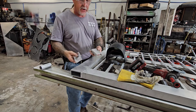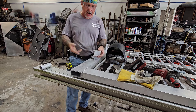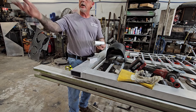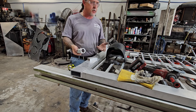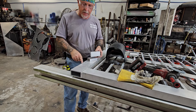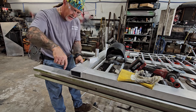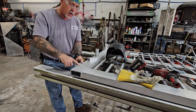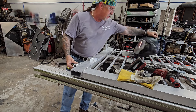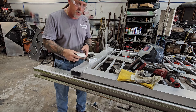This is channel for gates — I have scrap of this laying around all the time. A piece of scrap handrail pipe — I probably got 15-20 sticks of this, so drops are common. They go together like this, simple as this. Bevel the edge, bevel the edge. I come up four inches and you can see it's beveled in here so when it's welded it'll get good penetration. This is quarter inch aluminum, and it gets welded on here. This quarter inch flat bar gets wrapped all the way around and welded all the way around — they're very, very strong.